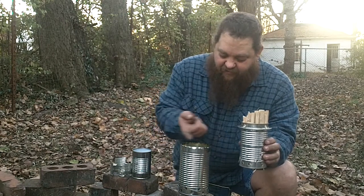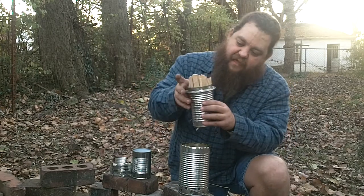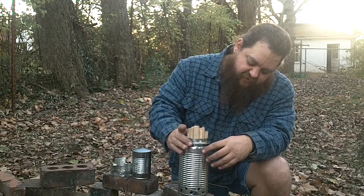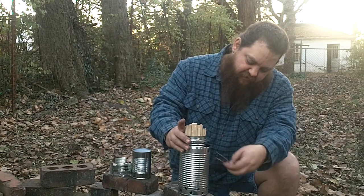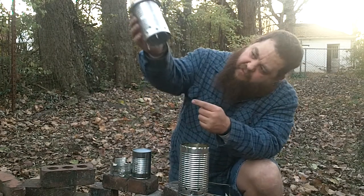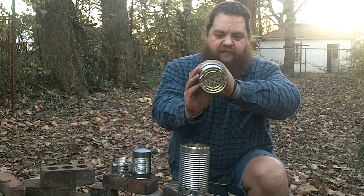Cut along the side, not the normal way, and that way you get the lip here from the top of the can. It's supposed to snap seal. I couldn't get mine to do that, so I made a little pressure hold down, like on the old style beer bottles. On the bottom of the inside can, I drilled a bunch of 1/8-inch holes.